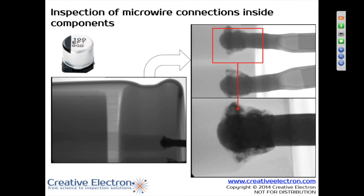No way visual inspection would work. Electrical test could work, but in the field or under operating temperatures you could have an intermittent failure. If you place the BGA on the board, everybody's going to blame that BGA and not necessarily a cap at the other end of the board. X-rays are invaluable for finding components other than BGAs that have problems placed on the boards.